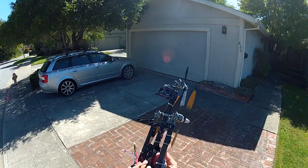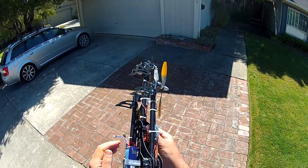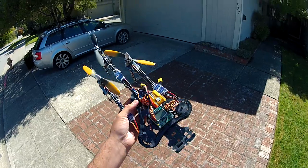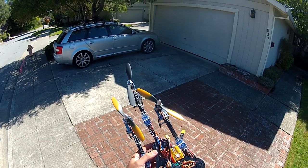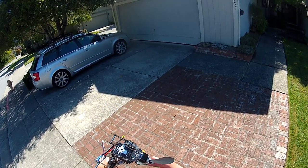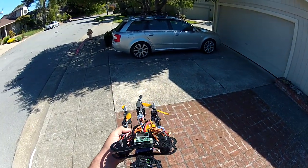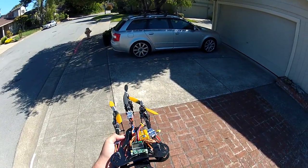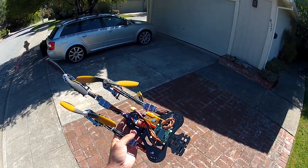This is a sweet little frame and one that's been in development for a very long time. Tricopters, as you probably already know, are unique in the fact that they're the most transportable as far as the folding configuration. The only downside is they do take a servo on the tail — that's the only way you can get yaw. So they're a little more complex and a lot of manufacturers just opt out of them due to that extra design work and complexity.